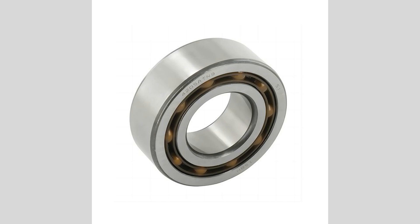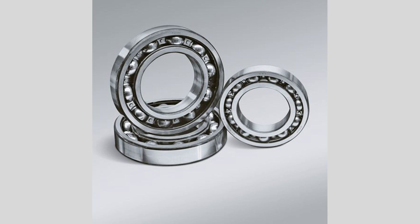Stainless steel bearings offer corrosion resistance, while ceramic bearings provide lightweight and high-speed capabilities. Proper lubrication is essential for the performance and longevity of angular contact ball bearings. Lubricants reduce friction and wear, ensuring smooth operation. Grease or oil can be used based on the operating conditions, and many angular contact bearings come with seals or shields to retain lubrication and protect against contaminants. Installation and mounting require careful attention to alignment. These bearings are typically designed to be preloaded, installed with a specific amount of axial load to enhance rigidity and minimize play, improving performance and extending service life.